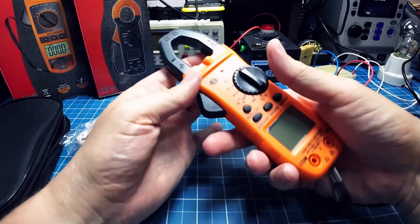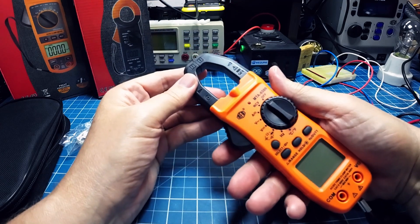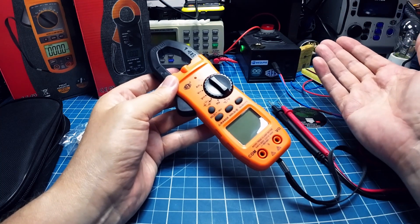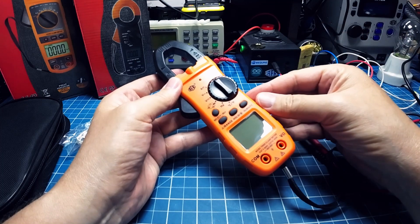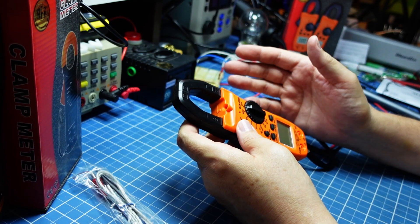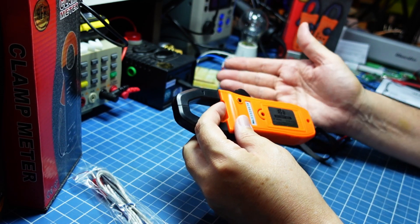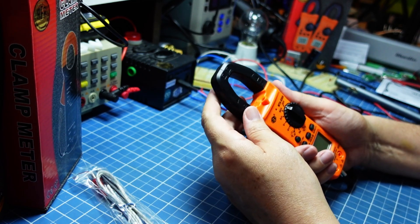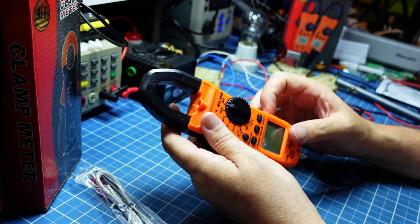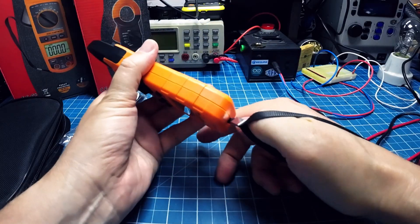It is straight and good to grip. It has a very reasonable jaw opening. It has all the features: true RMS AC and DC through the clamp, as I said. Cat 3 at 300 volts or Cat 2 at 600 volts. It reads 600 volts in AC and DC. It works with two AAA batteries, like the other equipment in the family. It is very small and very beautiful — a very nice piece of equipment. All plastic, but well built. It has a lanyard hole so you don't lose it, and a nice screen.